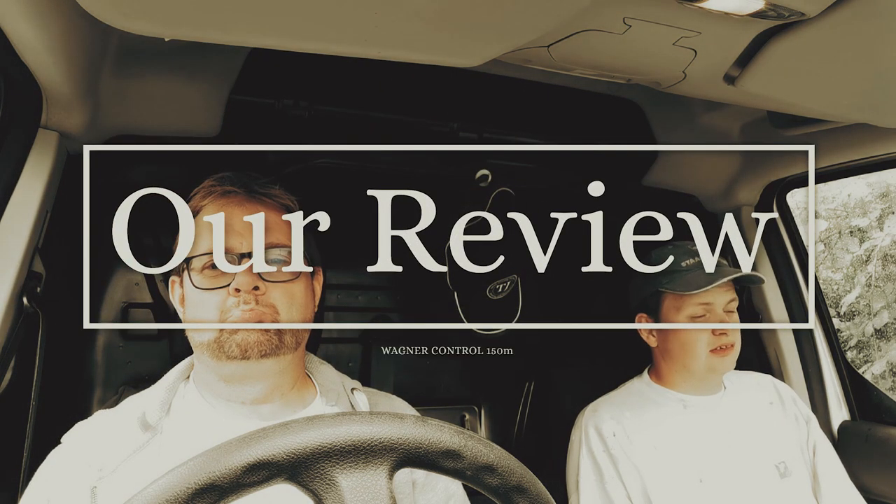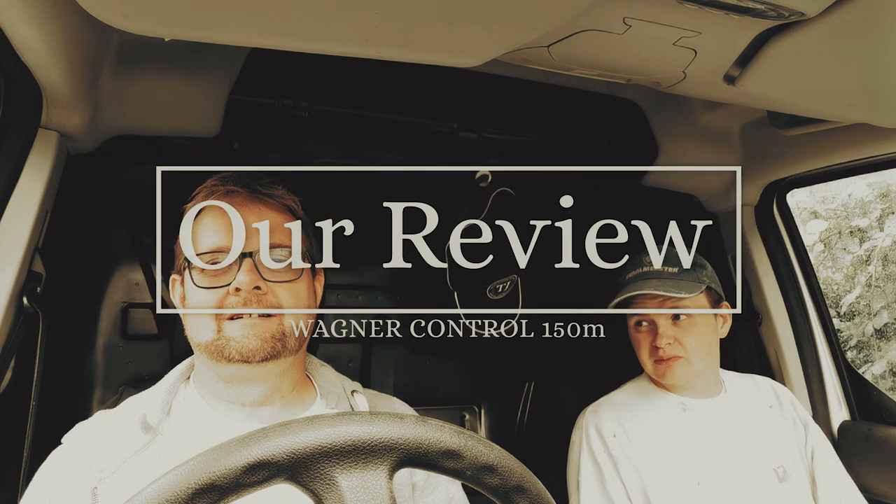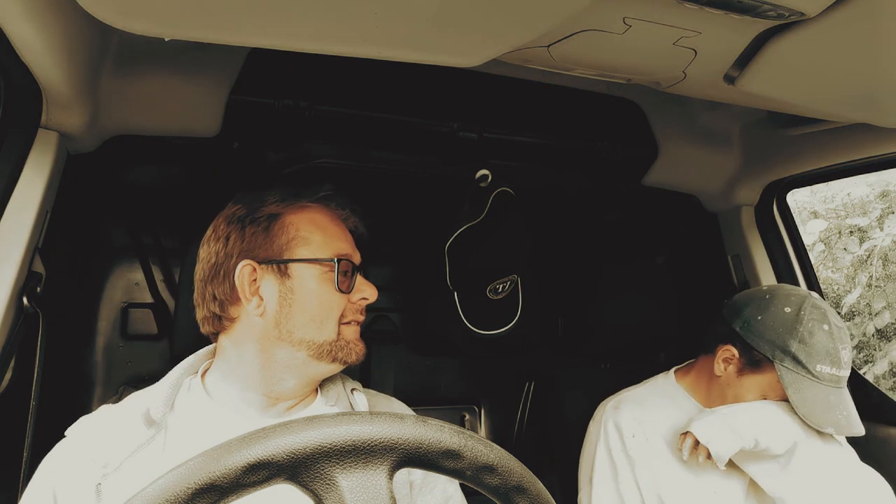Do you want to talk about the sprayer? What do you think of it? It's alright — it'll do if you're starting your first spray, I guess. I think it's a good machine. I think it'll help you find out if you like spraying or not. It's a good one to learn on because there's not much that can go wrong with it, there's not a lot of complication. You can't really adjust the pressure — all your control is going to have to be done by thinning out the paint. There's a little allen key to adjust the pressure but it doesn't make much difference.